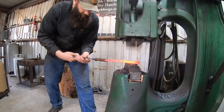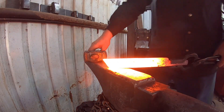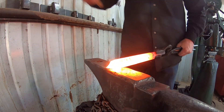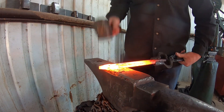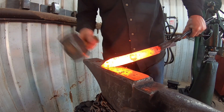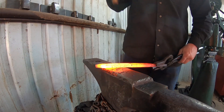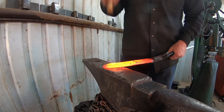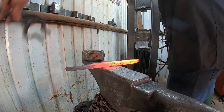I started with the tang or handle first — this is just a simple method of dropping down that tang material and creating a natural drop edge or guard to the blade. I started out with a little too little material for the handle and had to recalibrate. The angle cut into the end of the billet serves as our preform for the tip, allowing us to draw the blade steel around to the tip rather than simply grinding it in. This is also relevant to the pattern in Damascus — you're forging it up and around, following the actual geometry of the blade.